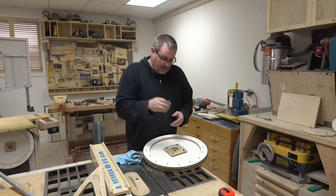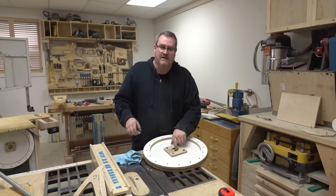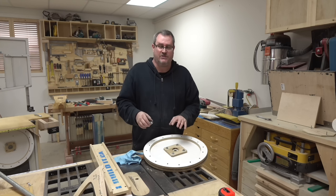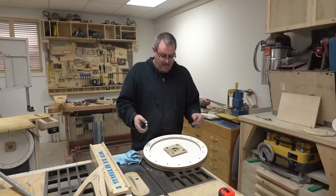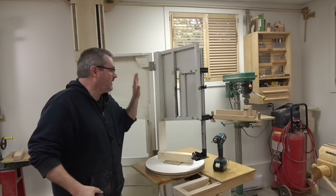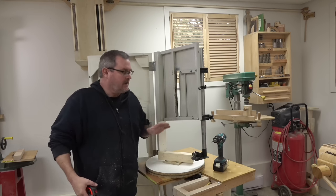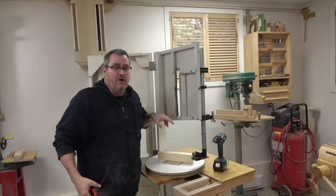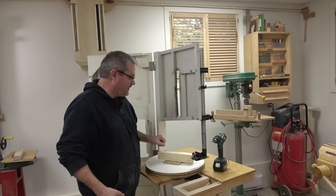And then this is a brand new bearing, but the problem here is it's sloppy inside that hole. So I'm going to try to shim that with thin aluminum from a pop can and see if that does it. I've got to try to figure this out. I didn't do any planning before this, mainly because I didn't know what I was up against here. And as you can see, I've got this big slot cut out here.